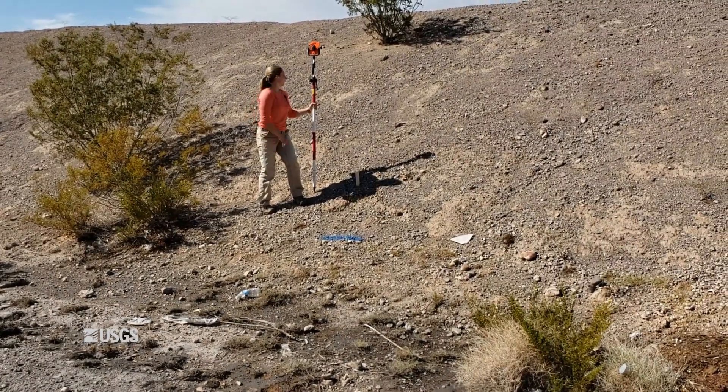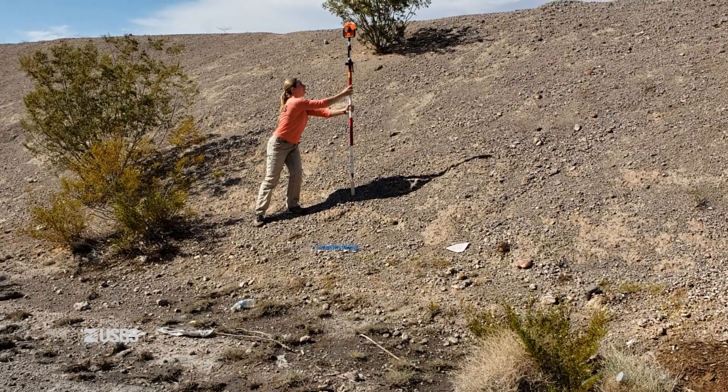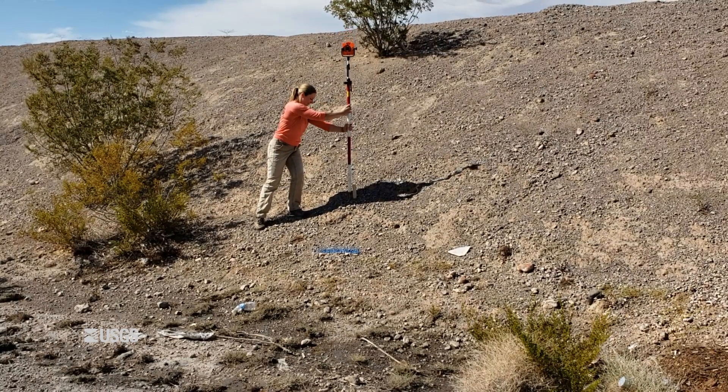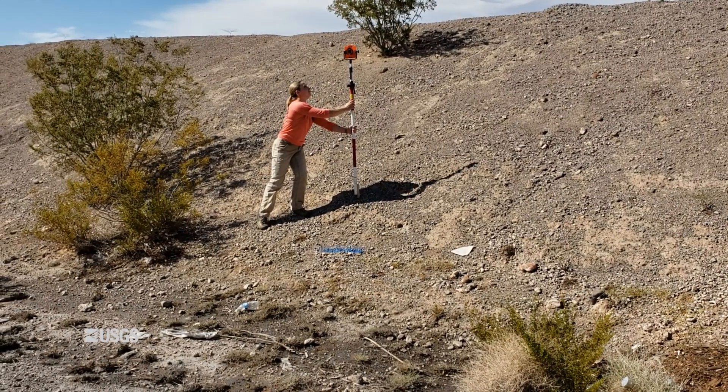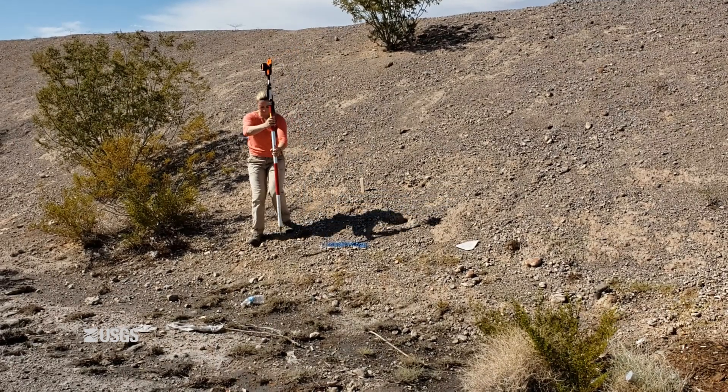Survey the top of the stake, then ground the stake at each end of the section. Why would we do this? As much as we want to get it right the first time, sometimes more data needs to be acquired. If someone has to go back for any reason before the indirect is completed, they'll be able to find the cross section again.